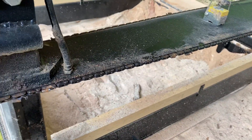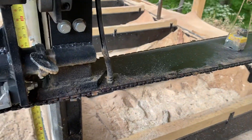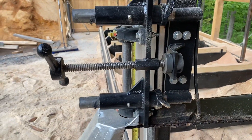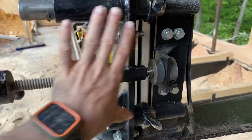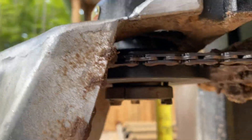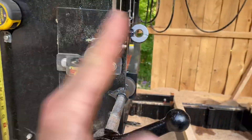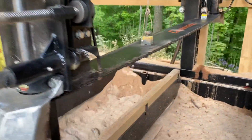This is your bar. Your chain is a hyper-skip or super-skip chain — there's about 12 inches between the teeth. This is your tension: you just turn and tighten this down and the whole plate moves back and forth. It's got bearing blocks, shaft, and sprocket down here. This can tilt this way and that way so you can get the shaft perfectly perpendicular to the bar.